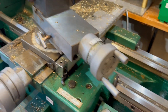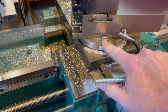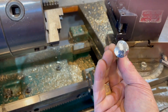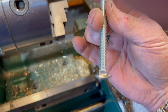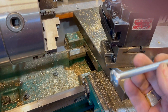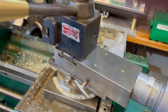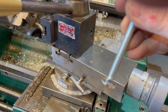Secondly, these bolts right here, these T-bolts, are horrible. They're weak, they're cheap, they're both stripped. Here's what you've got to do: get yourself a 5/16th carriage bolt. Grind a small flat in it right adjacent to one of the flats under the head. Cut it off about an inch to an inch and a half up, and this will drop right in the hole on this side. It'll drop right in — the square locks in with the groove. It works great.